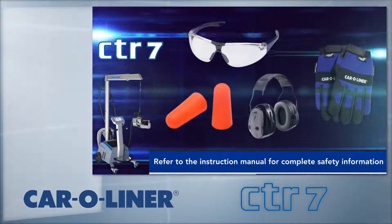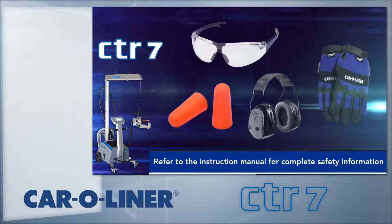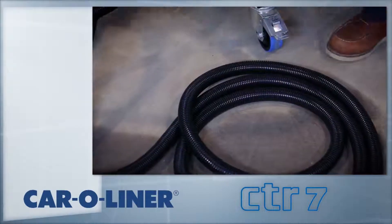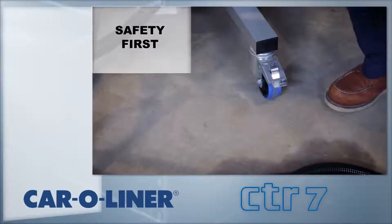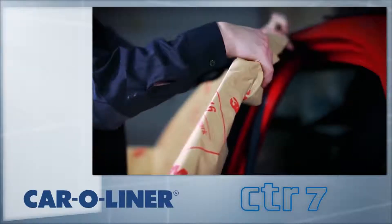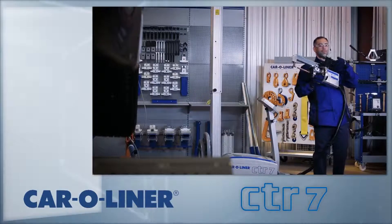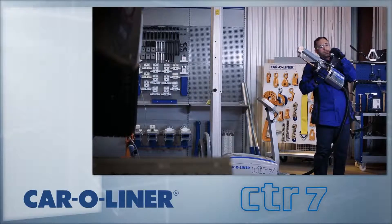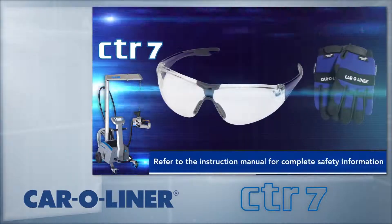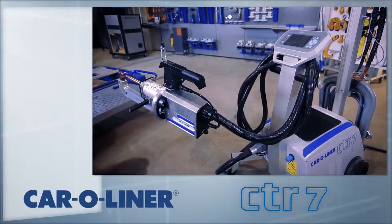As in any repair situation, please ensure your safety before preparing to weld. Welders must be used away from moisture or chemicals. Be aware of the potential trip hazard created by cords and welding cables. Vehicles need to be fully protected before welding, including isolating the electrical system. Be aware of the weight of the C-Gun and arms. Select proper personal safety equipment, including clothing, gloves, and eye protection. Reference the instruction manual for complete safety information.